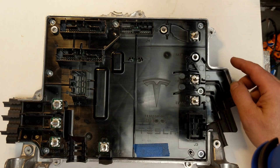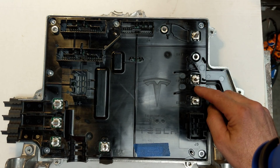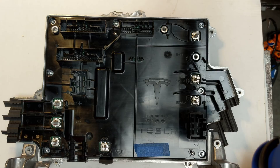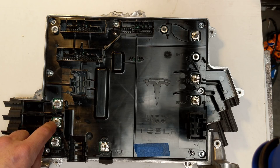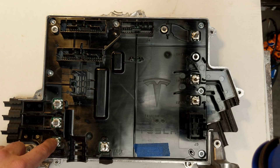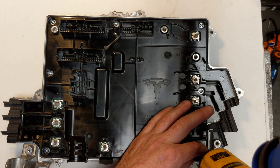Under here we have the main ground, battery ground connection for the power assisted steering rack — there are two connections for redundancy. We have battery positive coming in. This goes to the PCS, which is the output from the DC-DC converter. We also have VC Right power feed and VC Left power feed going out, and then some connections for the front harnesses. Let's dive into this sucker.